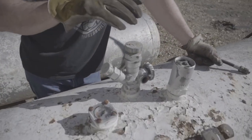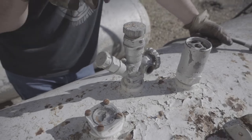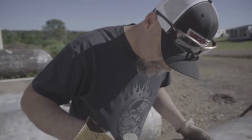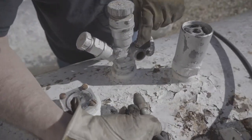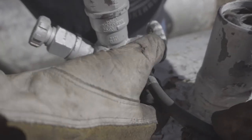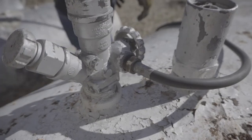The first thing you want to do - this is a combination valve, it's got everything on one: the liquid fill, the fill valve, the withdrawal with a long tube, and the main connection. Ignore the pipe connections for gauges. This right here will only fit if it's the absolutely correct fitting. Always use your fingers first, then tighten it down.